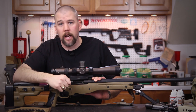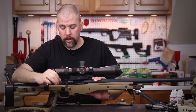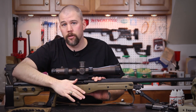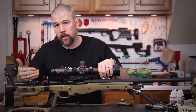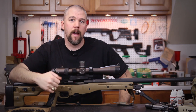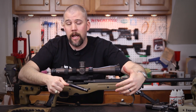The design of the bolt lugs in the AE Mark II gives you a little extra force when you are camming that bolt handle down. So if you get a round and it's a little bit sticky, a little gritty, or maybe you didn't quite get one sized down small enough, when you crank that bolt handle down you can actually do a little bit of resizing with the chamber. Being able to crush a round down a couple thousandths and still fire it versus having the rifle not be able to chamber and having to do a malfunction drill means a lot. Also when you start to get grit, nastiness, snow, ice, or water blown in there, the AE functions a little bit better than a Remington 700 because you have that little bit of extra force.